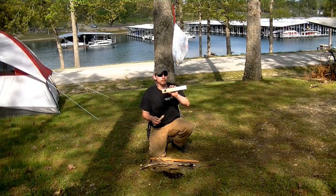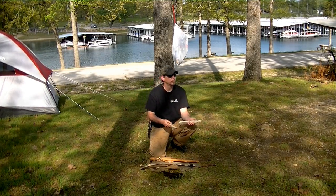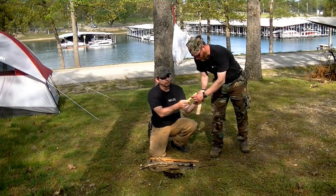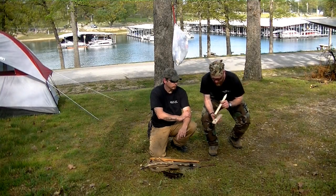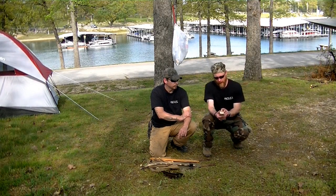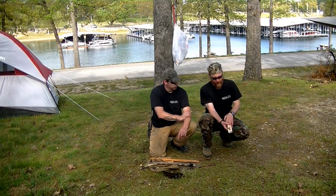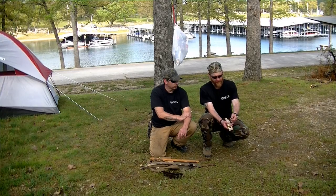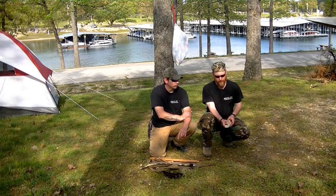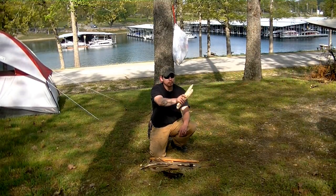The guide that I use is I take my spindle. Come on up here. I was going to say, I can show you a guide I used. He might be doing the same one. In order to determine where this socket is going to be placed, what I'll do is I take my spindle, and Justin's is right on, and I line it up to the edge of the board, and where the spindle ends is going to be the center of my socket. That's what I do. Okay. Yep. Me too. And that was your method too? Yep.